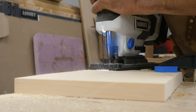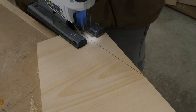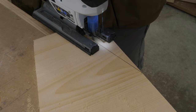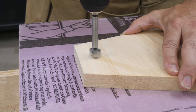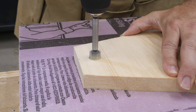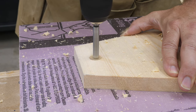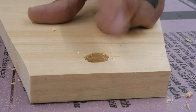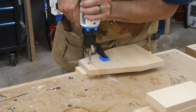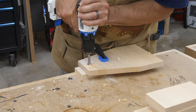After I clamped them down I grabbed my jigsaw and carefully made the cuts. Next I marked where I wanted holes for the dowel rod to go through — that would end up being the handle. To drill the holes I used a three-quarter inch Forstner bit. I forgot to use a scrap piece below it so I unfortunately got some blowout on the back. I did the second one correctly and it came out much smoother.